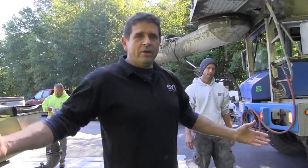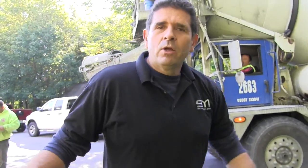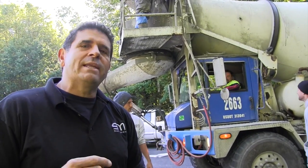All right, well, the truck got here. And the first thing you do when the truck gets here is you check the slump. Don't just go, I'm gonna throw the wall builder in there, because it's gonna bring it down about a half a slump. It's a water-reducing admixture.